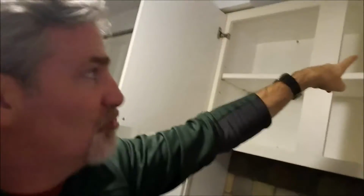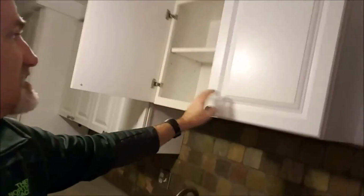these up inside. And if you take a look closely, look at that. This back plate, the back here is maybe 1/8 of an inch thick. And that has gone through the entire back plate and more than halfway through the nail plate that is holding this cabinet up there. So it's no wonder why this thing is pulling off of the wall. They've drilled through it more than halfway, and at some point in time, you fill this up with enough plates and enough weight, this thing is going to fail.